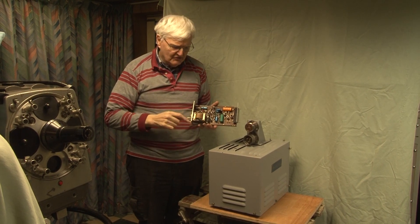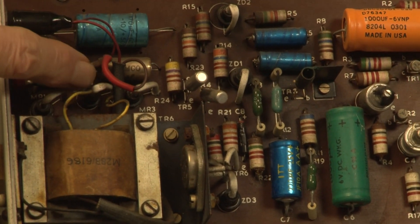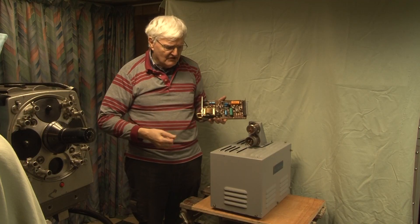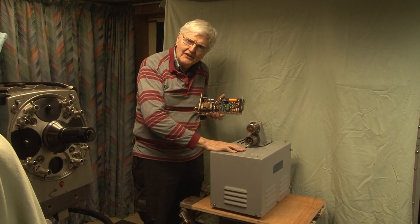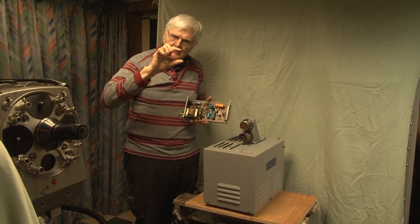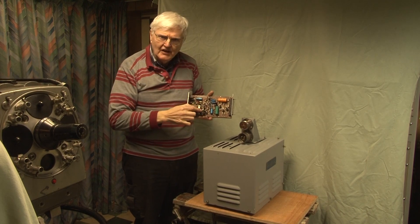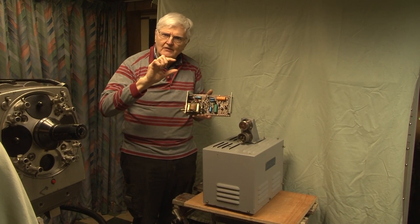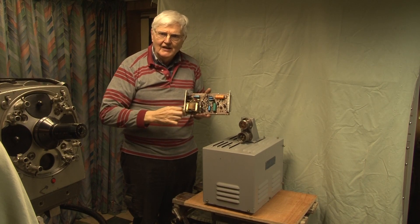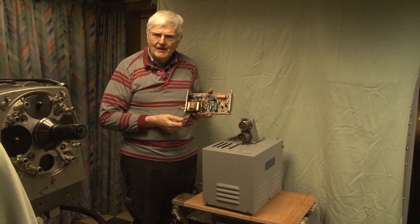If it's too much, you end up with a lot of heat and a bigger heatsink and a bigger transformer, multiplied by everything in the vehicle, and it starts to run away out of control. So what you have is a pre-regulator — the AVR — to give you a small mains voltage variation, which can be dealt with with a small headroom of excess voltage from the transformer rectifier into the regulator. And this all helps to keep the heat down and give a stable output.